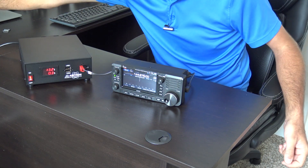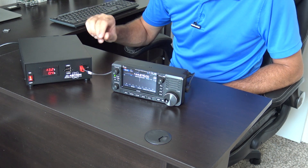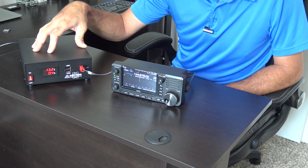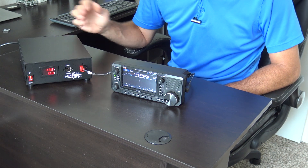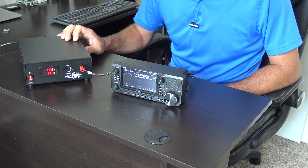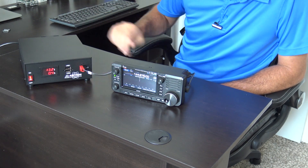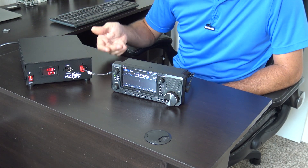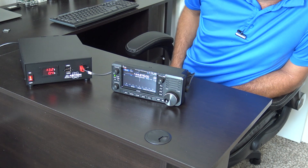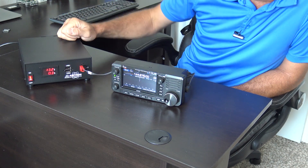I could have this set up by my monitor with an HF radio running. A 25-30 amp supply like this will run an IC-7300 or IC-9700 — not at the same time, but any HF radio at 100 watts draws about 20 to 24 amps depending on the technology. You could plug one radio into the back screw terminals and a couple into the front Anderson power poles, running one at a time — three DC outputs total — plus USB ports to charge phones, camera mics, or wireless microphones.